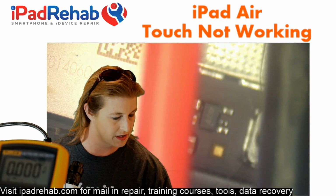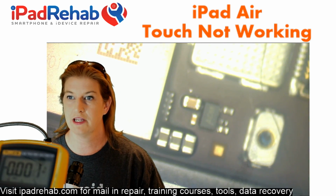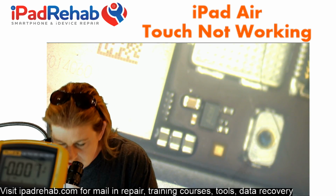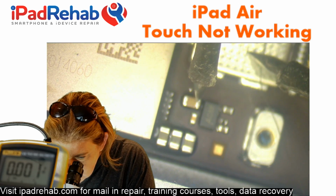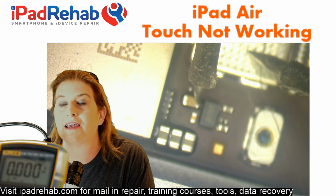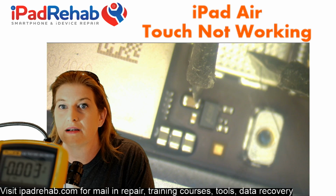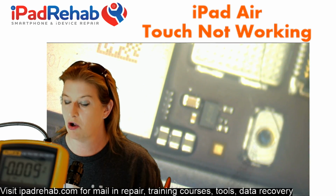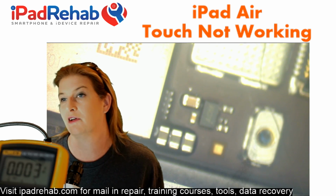We're going to unplug, plug. So that should wake him up, so that we should have a voltage there. And let's see if we do or not. All right, so I'm just taking a simple voltage measurement with one probe on ground and the other probe on the line side. And what does it say? So that's the reading. It says 0. 0, it should be 1.8. So let's go see if we can figure out why.